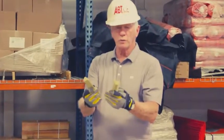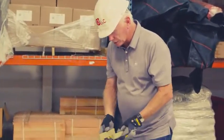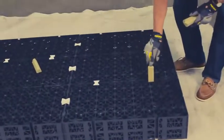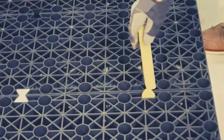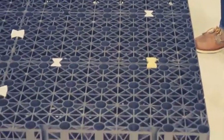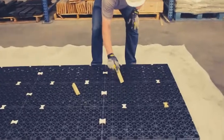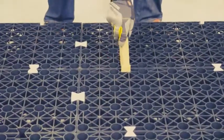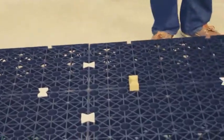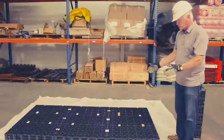The wicking cones are a rock mineral that's been crushed and pressed back together — kind of like fiberglass, so you don't want to get it in your eyes. Goggles are a good idea. Where we have removed the tie connectors, you press them in all the way. It's very important that they go down all the way and touch the wicking fabric. You can see we're going in our diagonal — the next one would be over here, then over there and over there. This is the way you would assemble this.